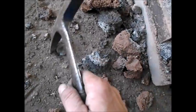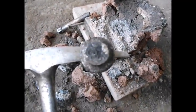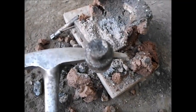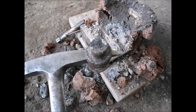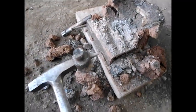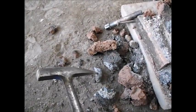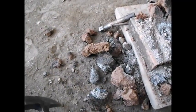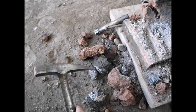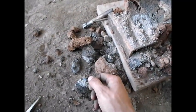Well, not too disappointing — it was kind of cool to make though. What I'm going to do is go ahead and grind it out. It did melt it a little bit, but it just didn't flow in and melt it enough. I'll bevel it and then weld it with a regular arc welder. I mean, that does work, it just won't be as good as it was before. As for this piece of very hot high carbon steel, I think I'm going to make a knife out of it — it's some pretty good steel. Alright, hope you enjoyed that, I'll see you next time.